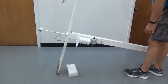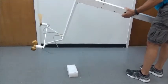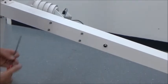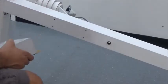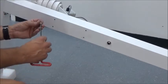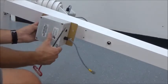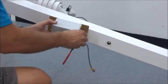You're going to take your assembly and rotate it 180 degrees, then place it back down. Support it to give your wind speed and wind direction sensors a little space so they don't hit. Now we're going to install the barometric pressure sensor on the side — remove the four allen screws and put it through the bracket, tighten them down, and make your connection.